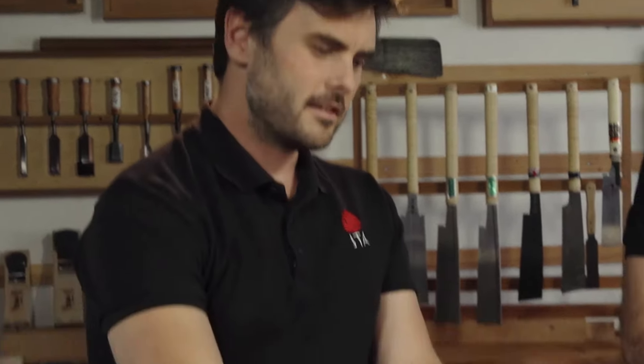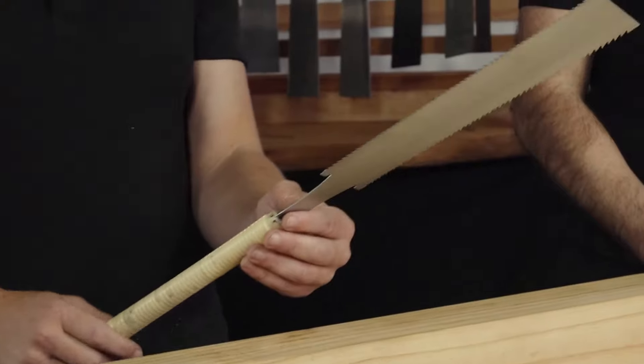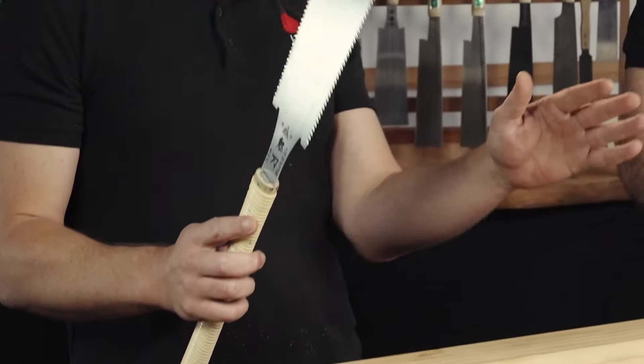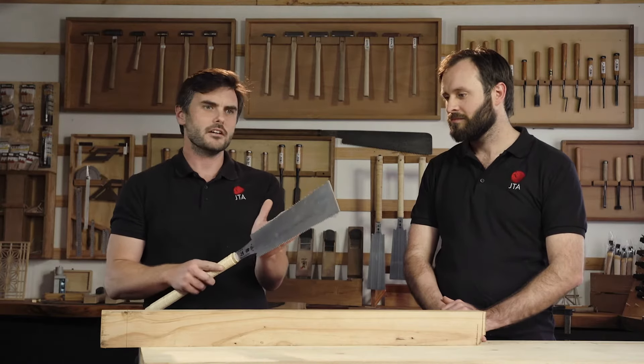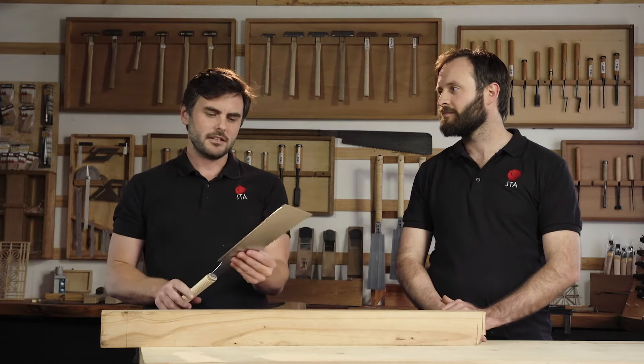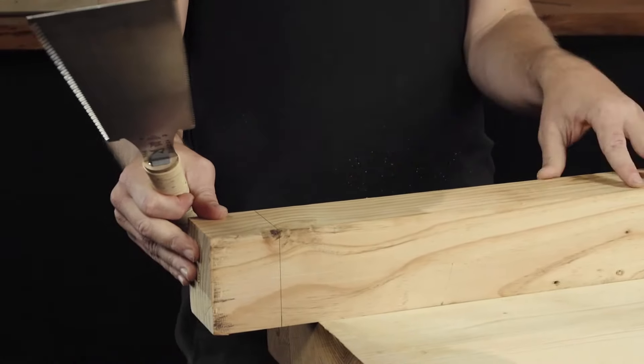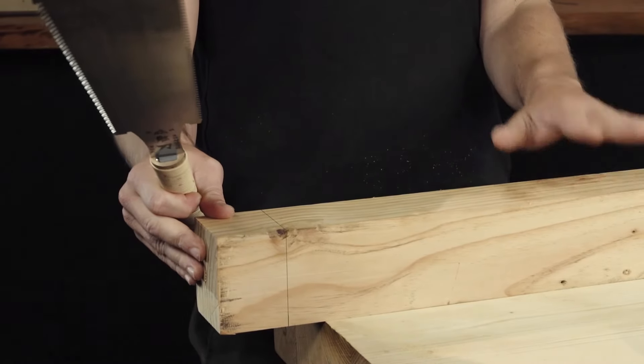That's a good question Mitch. A lot of people when they first use these saws will notice that they'll go for a straight cut, try to follow the line, and then about halfway through they'll find the cut is drifting either to the left or to the right. That's going to happen because we've all got a dominant left or right arm, and perhaps there's a little bit of a curve in the blade — all sorts of factors contribute to that. So what we have to do is counter those factors. There is a set technique and process that, if you follow it, you should get a good straight cut every single time.